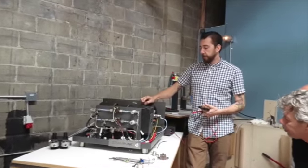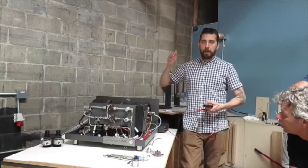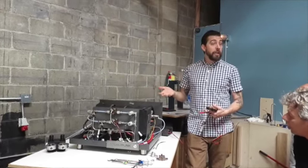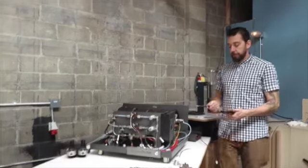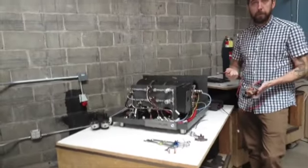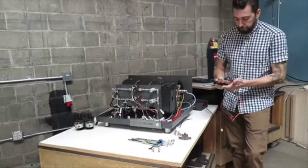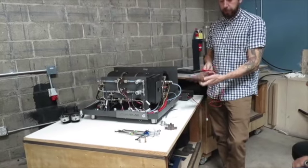I'd say the next thing that is more common as far as internal on machines is machines not heating or overheating, something like that. Something that you can kind of trace back to. It's got to be something with the heating element. So first thing you're going to want to check is, let's say my boiler is not heating. So the first thing I'll do, go to AC, because the heating element runs on 220 AC.